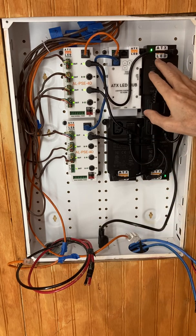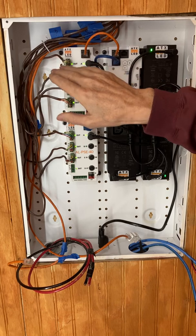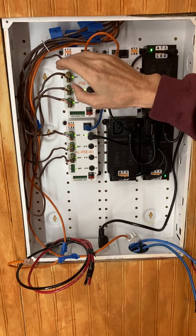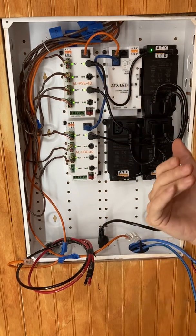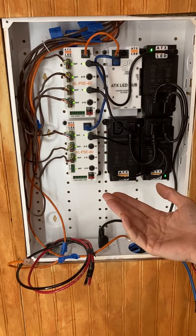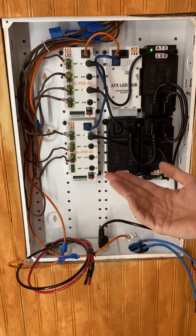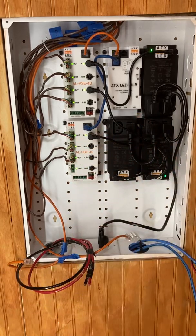So now we have power in, DC out, and DC to the switches. By NEC code we're limited to 100 watts on every one of these home runs. That translates into fifteen light bulbs of six watts each. It also means it could be between one and fifteen wall switches controlling any mixture of that combination of lights.